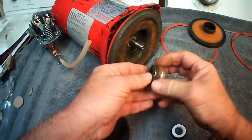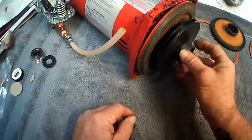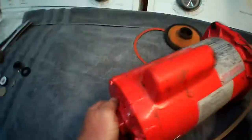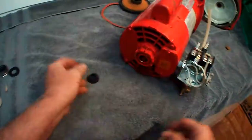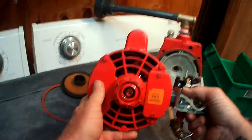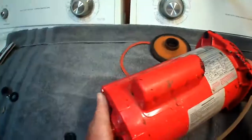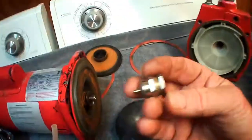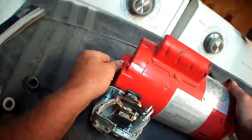I'm going to give you a quick rundown of how this goes together, because once I put the new parts on, I don't want to have to take them on and off. If you do have trouble getting this off, there is a cap on the back of the motor, which you should be able to do a screwdriver in there. You can see I had a little trouble, but it did help drastically to get my impeller off. Because when the impeller was broken, I was able to put a wrench around this to get that off. Put my cap back on, keep that sealed — dirt doesn't get in there.